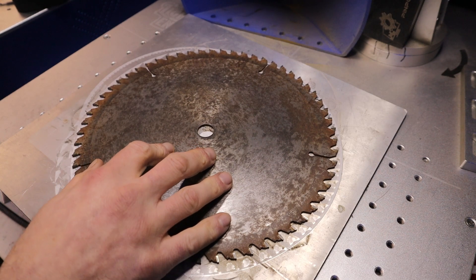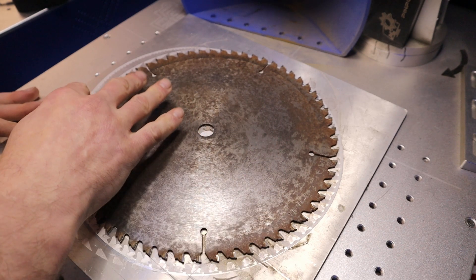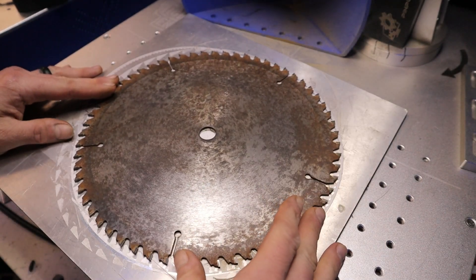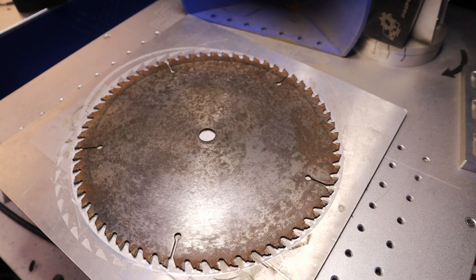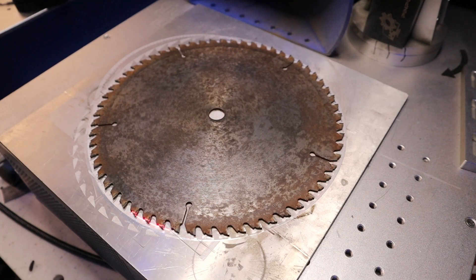You can see I have the saw blade underneath the laser. I like to use a quarter-inch slab of aluminum so I can just let the laser fall off the blade onto the aluminum base. As you can see, I've done several saw blades this way. I'm still at my 200-millimeter lens focal distance, so let me adjust that and get it to the right size. Now we're focused and framed — we're at the proper size. I need to make the circle just a little bit bigger to hit the outside of all those teeth. Looks pretty good — let's queue up some music and fast-forward through this.